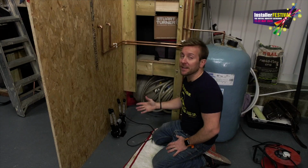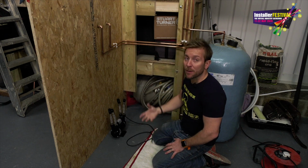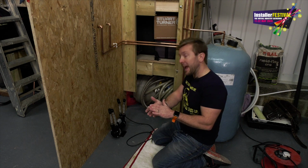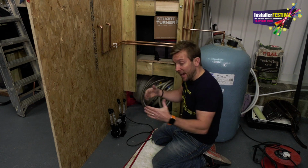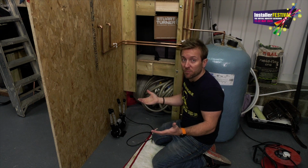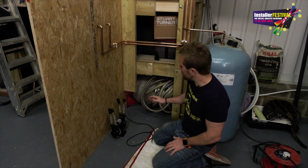So number one, can you get at it? Things go wrong. It's just life. You have moving parts, you've got joints, stuff like that. You need to be able to get at this. Sometimes you're going to find these hidden under the bath, especially at the head end of the bath, because you've got quite a slope there, and you can tuck it in there and get that hidden away behind the panels quite nicely. If you can get power there, you can get water there, I don't think there's a massive problem with that. But most of the time you're going to find these in the airing cupboard sat next to your tank just here.